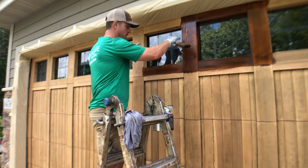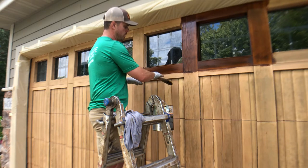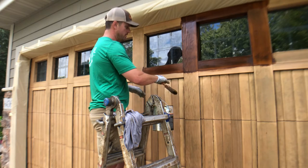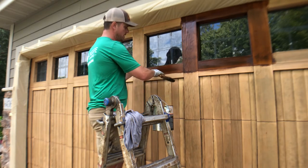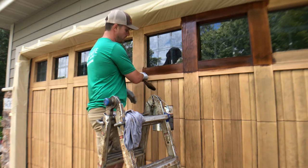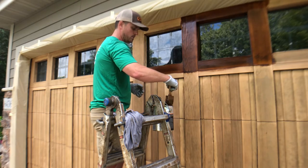I'm going to work on this piece and these inside pieces, then brush up here and spray down below. We'll mask and cover with a shield right here to protect the glass, then spray everything down below later. I don't want to come back down here while brushing because then it's going to get two coats and look a little uneven. So I'm going to try to cut this in as neatly as I can to get a nice even coat.